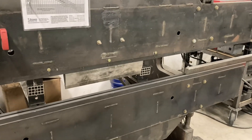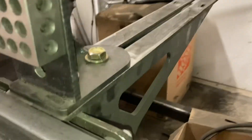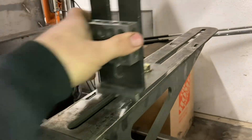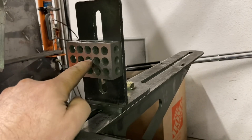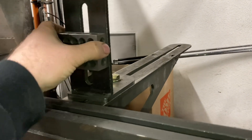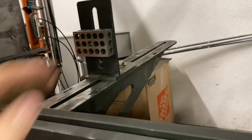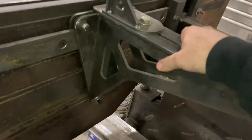I've got another little quick project I'm doing. I've got to make some pretty accurate bends. So like I showed in the last video, these are my adjustable backstops. They slide in and out that direction. I usually put these one, two, three blocks on here because they can reach up close, up over the top of the die if needed, and they're adjustable up and down. The whole assembly can slide down these tracks.